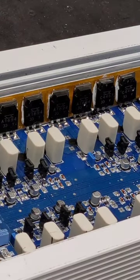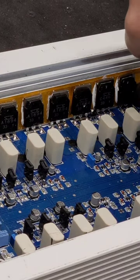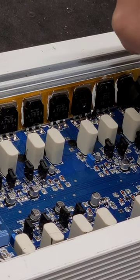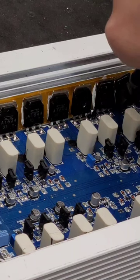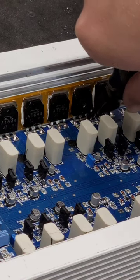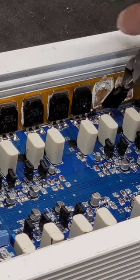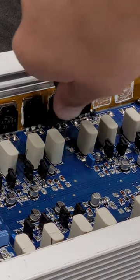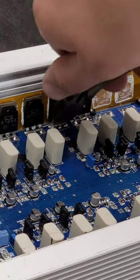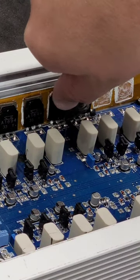So now what I'm going to do is, if they're shorted, there's no reason to keep them anyways. I've already taken a picture of the orientation of which one goes where. So what I'm going to do is actually snip these all the way out like that. Also, I need to check the resistors. I need to make sure that they're good to go as well. And I like to make sure that when I check those, I don't have any weird external influences on their resistance reading, like, you know, going through here. So I like to just get rid of these.